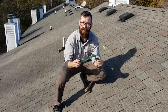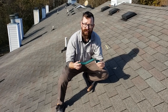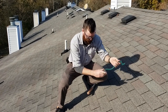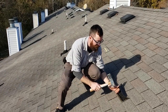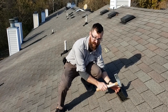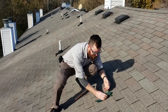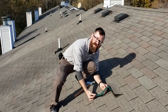This is the roof snake. It's made by a company called Pack Tool. They claim that it will allow you to ignore pliability concerns when replacing a shingle on a roof. The idea is you wouldn't have to lift the shingle as high. Normally, in order to drive a nail on a roof, you'd have to lift the shingle up high enough to be able to strike it with a hammer without hitting the edge of the shingle. By using this tool you can lift the shingle up, place the nail in, and because of the offset you only have to lift the shingle the height of the length of the nail that you're installing.